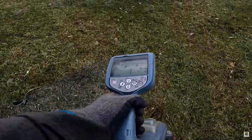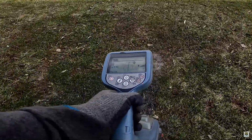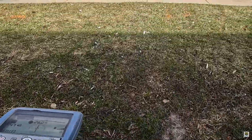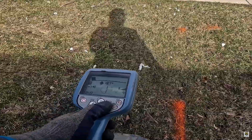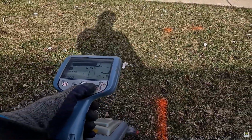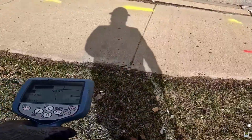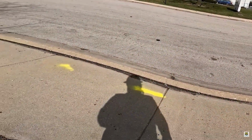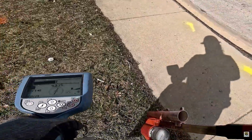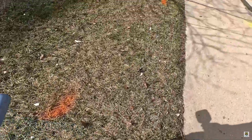So I'm nulling back to verify the null to make sure my cable, this is my cable, and the null's really good here. So you always pick it out first and then null it back. You're verifying your peak with null. That's all you're doing. You're not marking on null. You're just verifying your peak tone on null to make sure that you're on that cable, you didn't bleed off on something else. That's it for today.